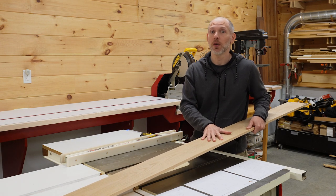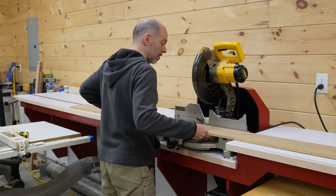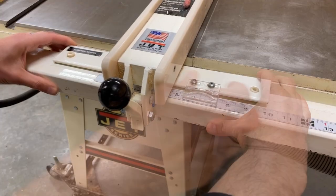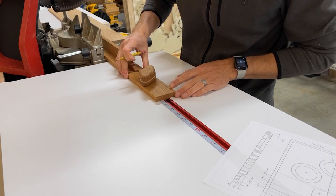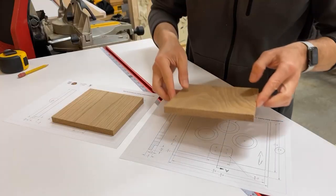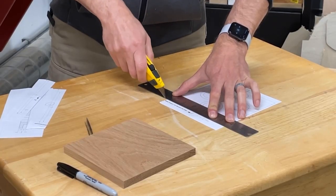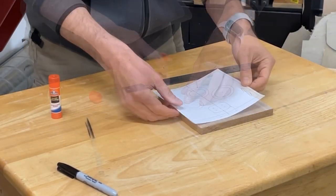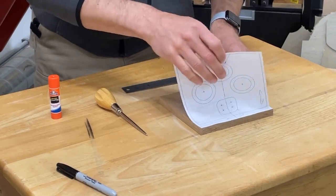I have this extra piece of half-inch white oak from our hook and ring game. It's the perfect thickness for a small box like this. To get started, I'm going to cut it down to length at the miter saw. After cutting them to the correct size, I used the full-scale drawings I printed from SolidWorks to locate all of the holes I needed to drill. I temporarily held them in place using a bit of craft glue. This lets me precisely mark the centers of all the holes with an awl. On square parts like this, I also like to draw arrows on the template that remind me which way I want the grain to go.